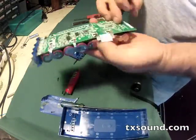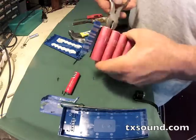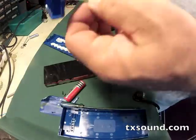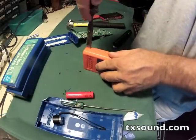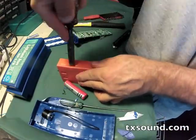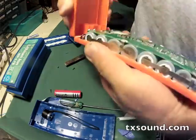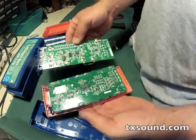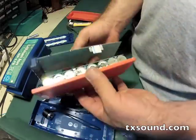The wiring scheme is the same between the VariZoom battery and the IDX. So I'll remove the old battery pack from the IDX leaving just the charging board, then break into the VariZoom battery — which has no screws and pops open about as easy as a box of cigarettes — and take the relatively new lithium-ion cell pack out of that one. They're wired the same way: four in series, and then each group of four is wired in parallel.